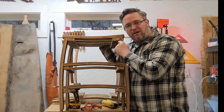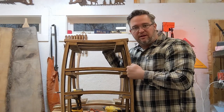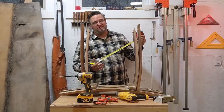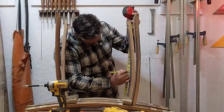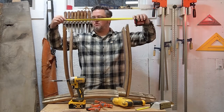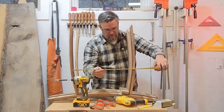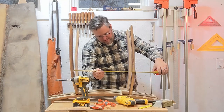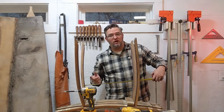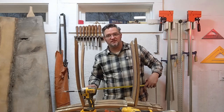I'll make this first level of support about seven and a half inches from the support piece on the seat. I'll go around to each leg, measure down seven and a half inches, and put a little tick mark. For this measurement, it's okay to use a normal tape measure. You'll notice these legs are all wonky — at the top I'm at 19 inches across, and in the back I'm at 18 inches across. I'll take a measurement between my front pieces at that seven and a half inch mark — that's 17 and three quarters. On the back it's 17 and a half. So I'll split the difference and make each of these first cross pieces 17 and 5 eighths inches in length.